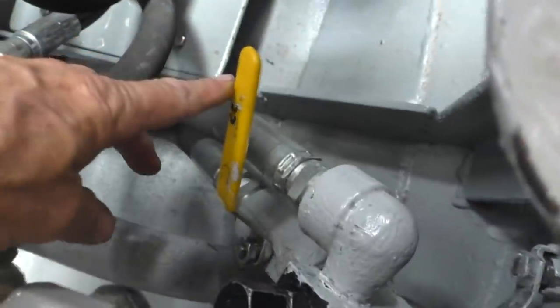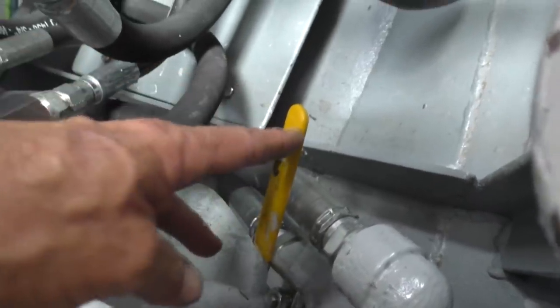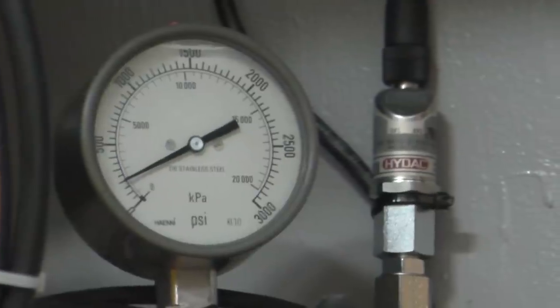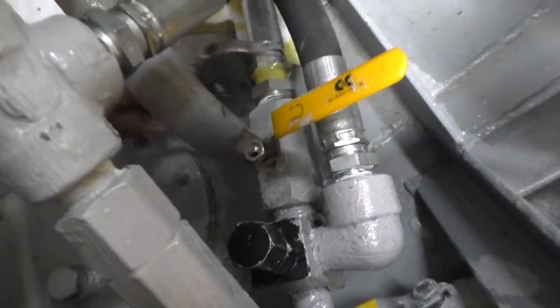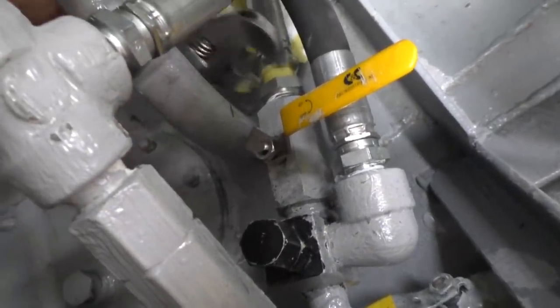It was up to like 800 PSI before the trip. It's doing pretty good — it's definitely pulling 200 amps. So I'm going to open the valve to the accumulator. The pressure that's currently in the system — just pipes and hoses — will go into the accumulator and they'll run the pumps for a little while and charge the accumulator up a bit. Opening the valve, we should see that pressure drop off to next to zero. There it goes — I heard it. There's the first leak. I don't think I ever tightened the accumulator fitting — I just pushed it in there by hand. That's a nice leak.